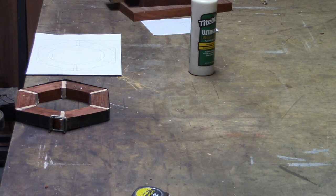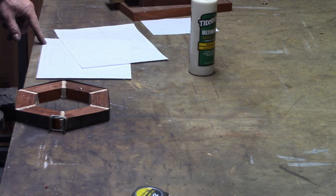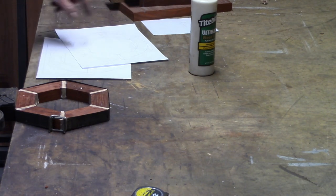So the next step, I'm going to glue it to a piece of 1-inch MDF, according to the template, because the template has marked on it where the zero point is, and the router needs to know where zero is when it cuts the pattern. And yes, the pattern is a little bit oversized, so I don't have to nail it within a thousandth. But next operation will be to stick it to a piece of MDF, take it over to the router, and route the profile. And I'm probably not going to show any of that, and the next time the camera is turned on will be at the router. So see you later.